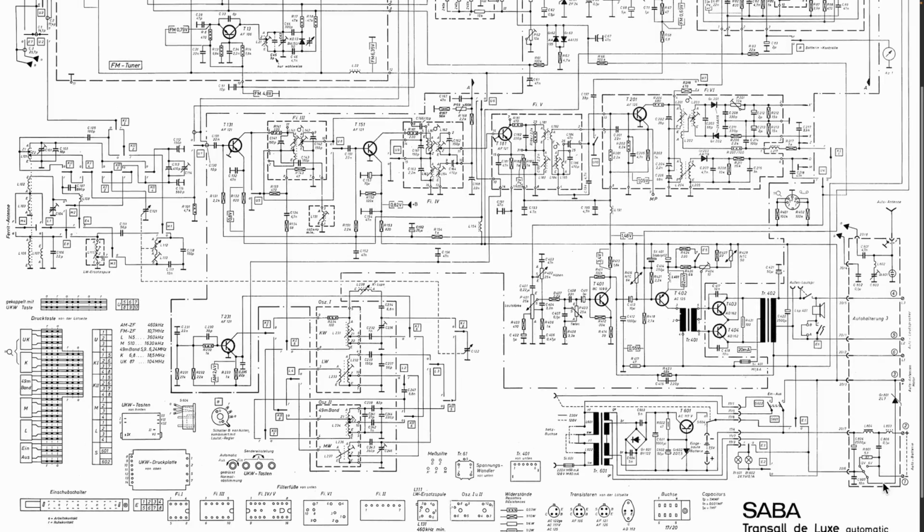Actually, I think the big one is 2500. I think the big one that I've seen on the board is that guy over there. It's got to do with the connector that receives the signal from the radio, from the car radio. Okay, all right, this is looking good. But there are a few more electrolytics. I'll find them. There's 1 microfarad over here. There's 25 microfarads over there. Now these things are like, 10 volt? And they saw 13. Not good. I think I'm going to have electrolytics to replace before I try anything else.